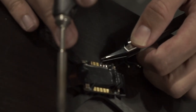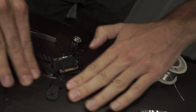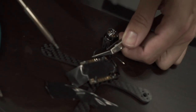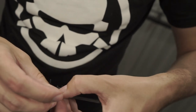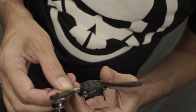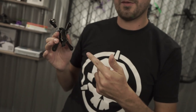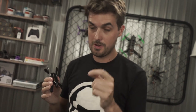Tape the whole frame down so it doesn't move around. Hold the pre-tinned wire onto the pre-tinned pad, apply heat, and it flows together. Once the wires are soldered, flatten them down on the arm and grab the long stickers to wrap around and hold the wires down. So from start to finish: mount motor to frame, run wires to four-in-one, cut to length, strip, pre-tin the wires, pre-tin the pads, solder them together, and repeat for the other three corners.